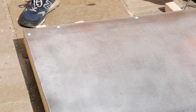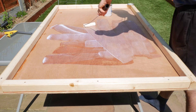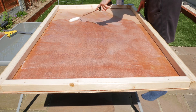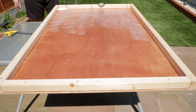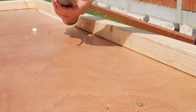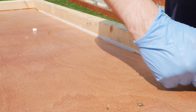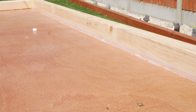After countersinking, I gave them one last sanding to clear up any rough edges — I wanted this as smooth as possible for the paper. Next I sealed all of the inside of the box with normal wood varnish, making sure I got into all the nooks and crannies. After about three or four coats, letting it dry an hour or two between coats, I then applied a silicone sealant around the edges. Don't be scared to apply a lot — I went quite heavy to make sure I sealed up absolutely everything, since any air leaks would reduce the effectiveness of the table.